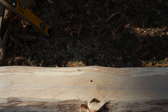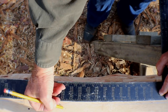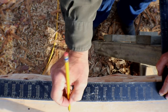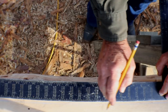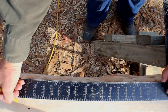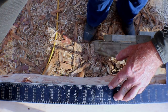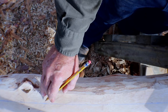I've got a blue line now. That line's a little bit faint, which is okay — I'm going to pencil that in. If you look at this chalk line, it's about a sixteenth of an inch wide and I want something a little bit cleaner and more precise than that. So I'm going to make a mark right in the center of the chalk line, get my square right on those two marks, and just mark that with pencil right down through there. That gives me something a little bit more precise to work from.